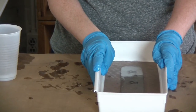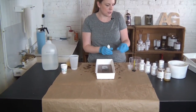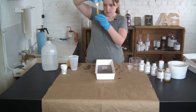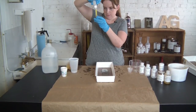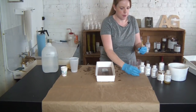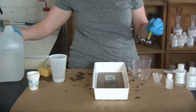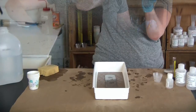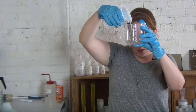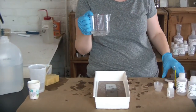The first process is tin for silver. Tin for silver is a pretty concentrated solution and you'll only need two milliliters. I'm going to put that into my 16-ounce cup here and then dilute it with distilled water — a total of two fluid ounces of distilled water with the tin. I've got my tin ready and my timer on hand.